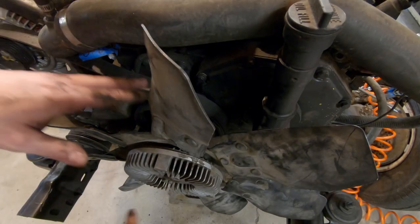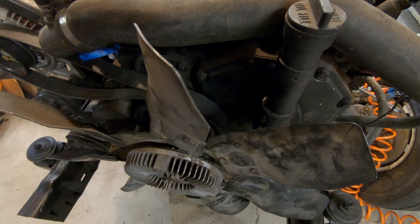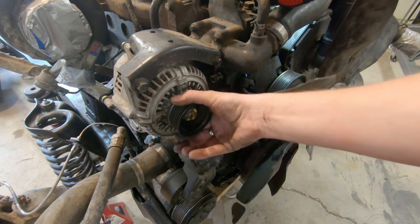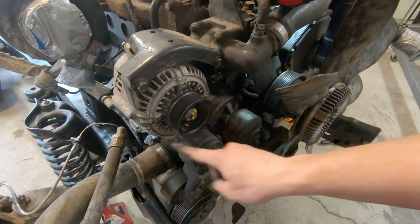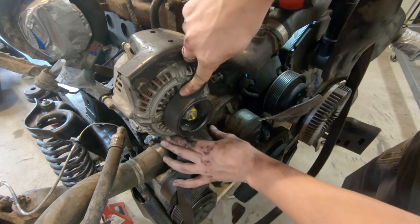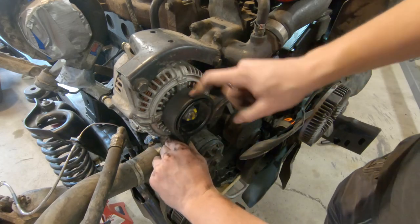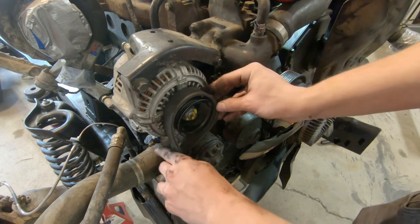I want to show you how I cracked this loose because I think it's a useful trick. The basic principle at work here is that if you have a pulley with a belt around it, the amount of friction — the holding power you get on that pulley — is determined by the angle of wrap around the pulley. So if I have a belt that's approximately 50% angle of wrap versus one that's approximately 100% angle of wrap, I'm going to get way more friction with 100% wrap.